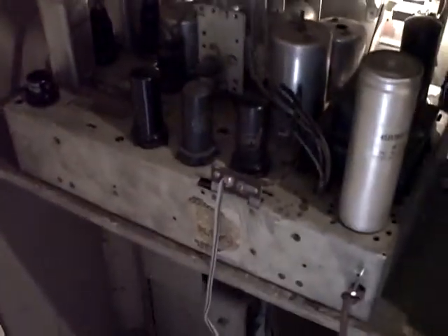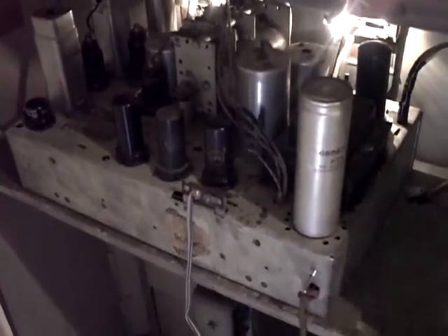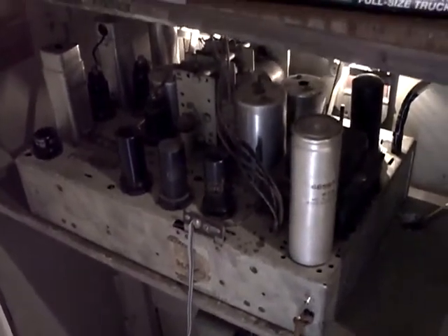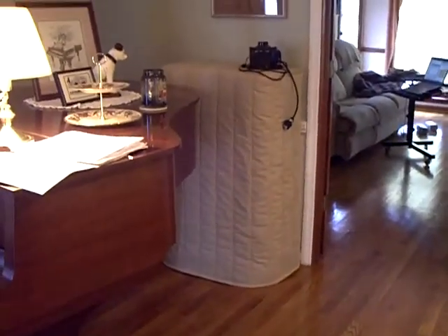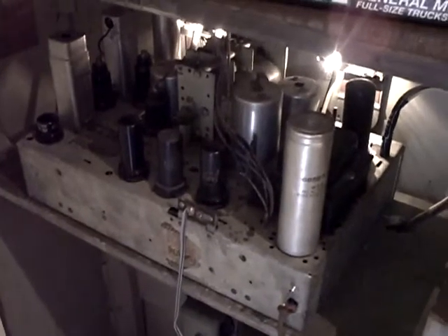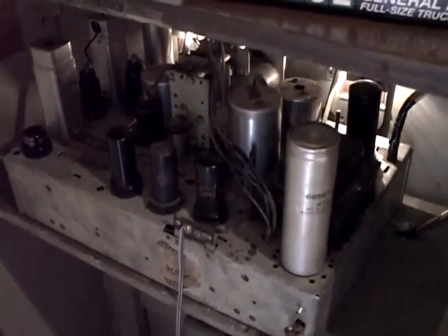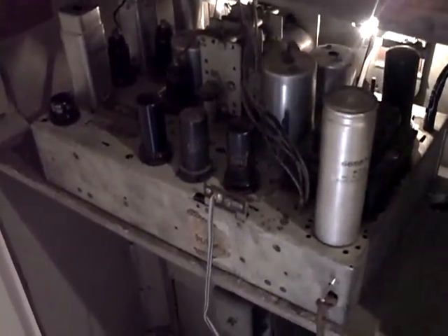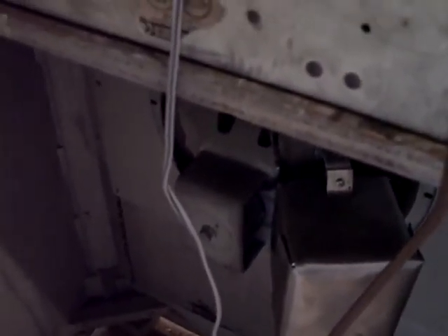This radio has no fuse in it at all. By 1938 there was a little recessionary dip and I think they started making radios cheaper and faster. The 262 went for about $200 new, while this radio went for about $95 to $100 — roughly half the price of the 1934 model. They tried to make them cheaper and claimed you could run it from 105 to 125 volts, but I think they're at the upper limit of this transformer's design.